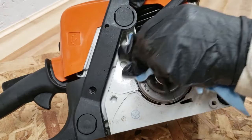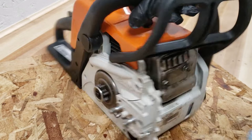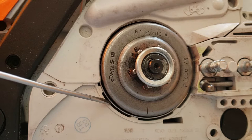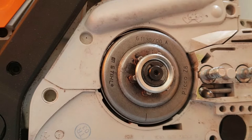When wiping down the main saw body I pay particular attention to the oil outlet channel — that's where the oil travels from the saw into the bar, so you want to make sure it's clear so the oil can flow freely and lubricate the chain. Make sure that channel is shiny before you reassemble. I also make sure the chain brake mechanism is clear of gunk. When the chain brake is on, a little band tightens around the drum, so you want to make sure nothing has accumulated in there.